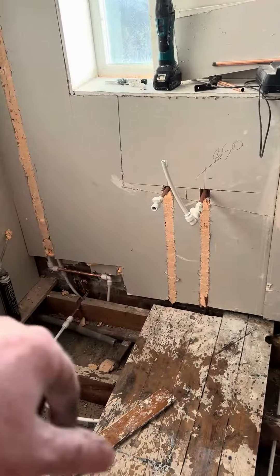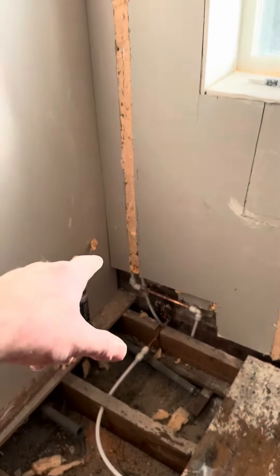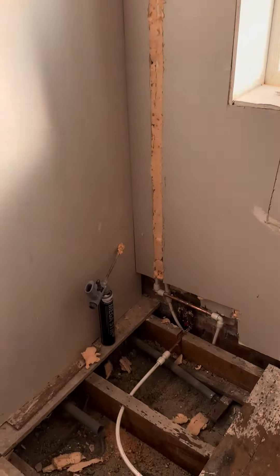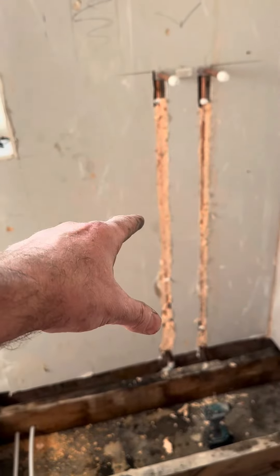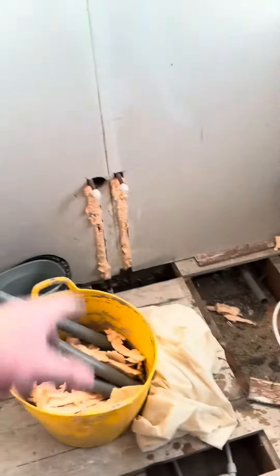Three of them. Then it comes down back here, goes to the shower, goes to the tap on the bath, then it goes upstairs into the loft into the boiler. The boiler is working at two bar running pressure as well. The hot comes straight back down, straight up to the bath — it's not running away — straight up to the shower, so it's not running around.